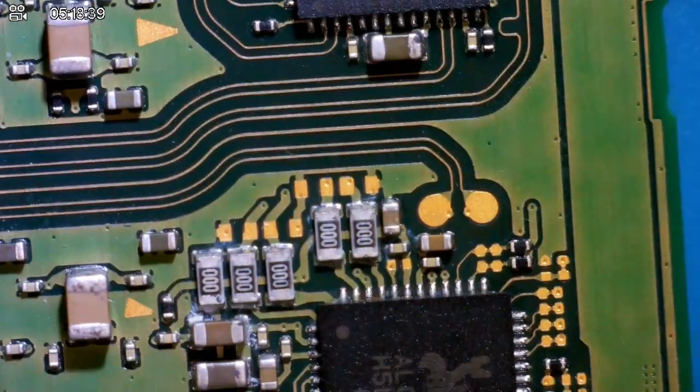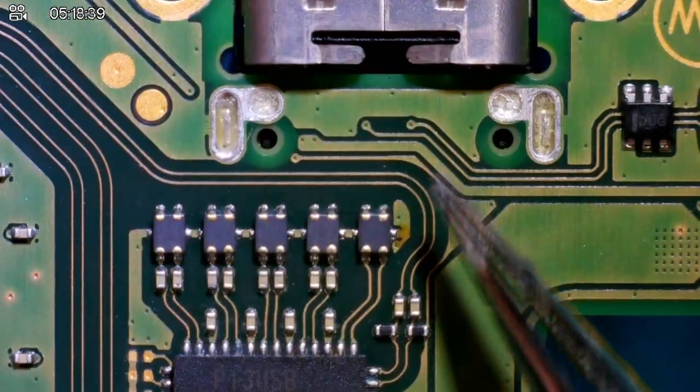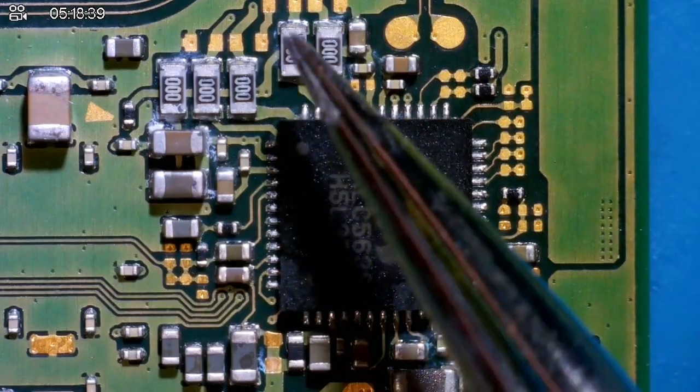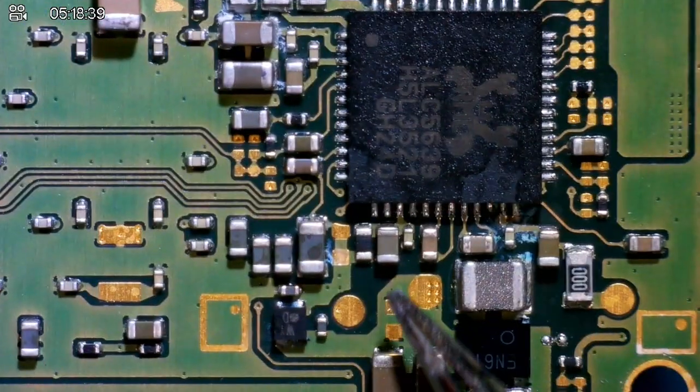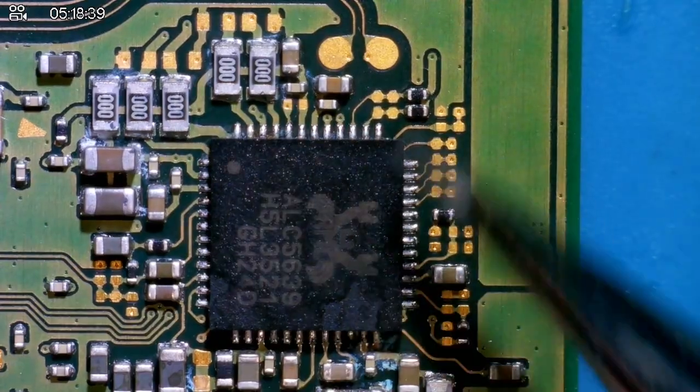And then if we turn the board over and look at P13, you can see that around P13, this also looks okay. Little tiny weenie bits, but nothing too major. And then like I was talking about, you can see I've left the other areas of the board, so you can see all the corrosion around here. I'm just gonna leave that for the time being, because it could indicate specifically a fault with something. If I clean that with IPA, I'm gonna be a little bit screwed.